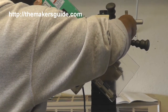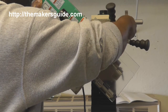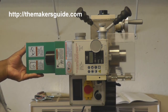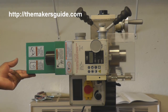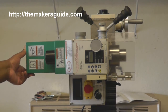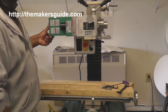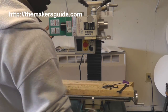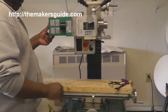You may want to remove one of these handles to make your life easier. I just wanted to rotate the headstock so that it was 90 degrees off — zero zero here — so that I could drop it down onto the bed of the mill. I put a couple of two by fours there to avoid scratching the mill with the metal parts. Move the table in so that it's underneath and make sure everything is out of the way.